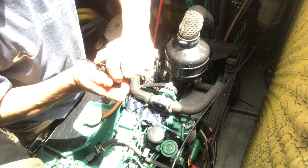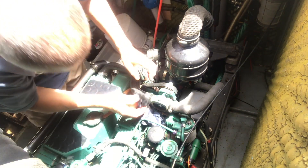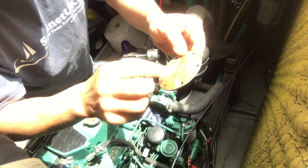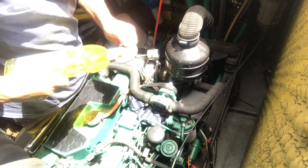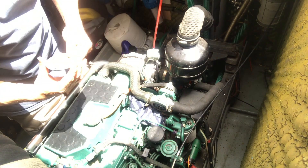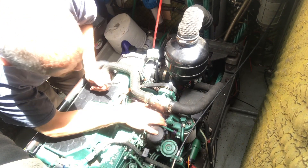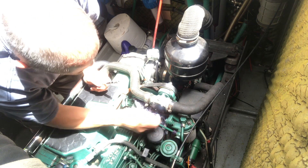When I push it in, the cable tie should slip off. I always try and make sure the numbers are on the outside. I can see the outline of the cam on there so I'm going to reinstate it the way it came off. Line up the gasket with the cam. I've also heard that if you put lubricant on the gasket it has a tendency to splay out and not create a watertight seal, so I'll go along with that advice. Put the screws in diagonally so when you come to tighten it up it doesn't buckle the plate. I've put a bit of rag just underneath there to collect any drips and stop salt water getting into the engine bay, and also to catch any bolts you drop.